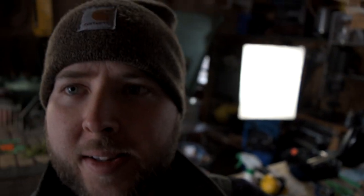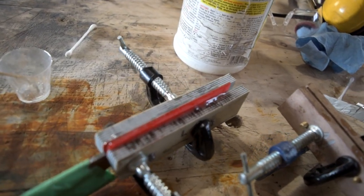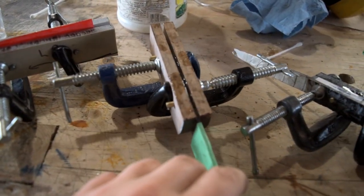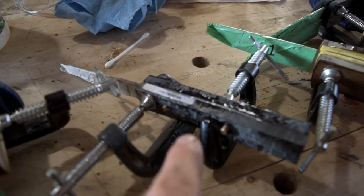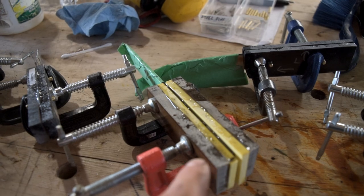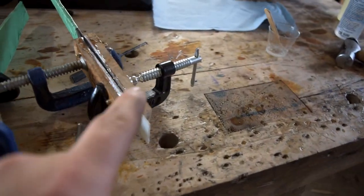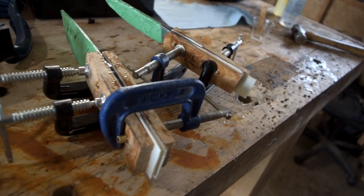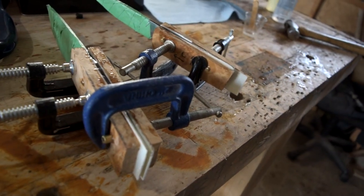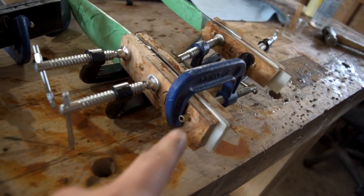I have all of those blades glued up including that little German knife. Let's take a look at what we chose: one of the mirror-polished santokus is getting that zebra pattern micarta with red liners; the polished Islander is getting black walnut; that little German knife is getting some grey dyed curly maple — that's going to be beautiful, stabilized wood. We have a Tuckmore here with yellow camo micarta. We have that belt-finish santoku getting black micarta and brass pins. And then that set is getting some bird's-eye birch — it's also got some burl in there but primarily bird's eye, really wild stuff — along with white micarta liners, brass pins, and the big one is getting a thong tube as well. I've got to get those inside now in the warmer temperatures to get the glue to set up overnight.